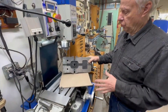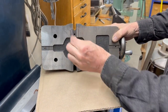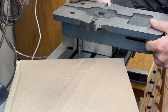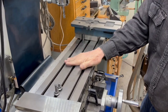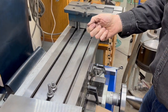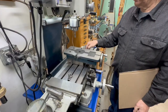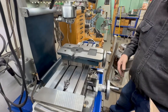The first thing I'll show you is how I did it before. What I did was I put two blocks in here that just fit in that slot, nice and solid. Then I had a bar — which I have lost in the meantime — that fit right into here, absolutely perfect. I think I milled it, and I had it marked so I could save it. I put the vise down there, clamped it up on the bar, and milled the two sides of the blocks so they would just fit in that slot. And that's pretty accurate — within one or two thousandths.